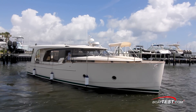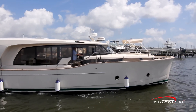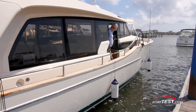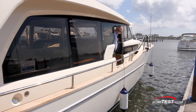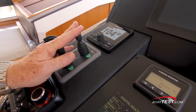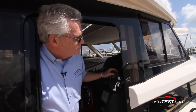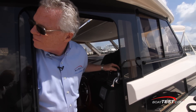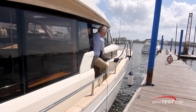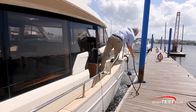When it comes time for docking, there are some pretty cool features at work here. The running gear consists of shafts, props, and rudders — old school and it works really well. She has excellent controllability and she'll walk sideways quite nicely. I laid her up doing exactly that, and when getting close, just a fine-tune with a shot of thrusters was all it took. There's also this opening side door — with this combination you've got complete controllability and an excellent sight line of the whole starboard side. We can step out the side door and drop a line onto a cleat or piling right back to the midship cleat, making this 40-foot boat easy to tie up, even single-handed.